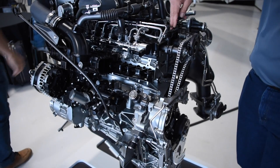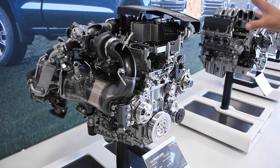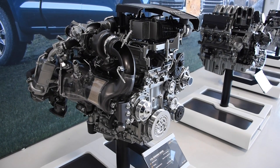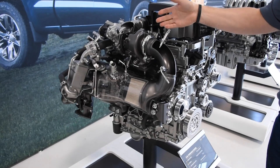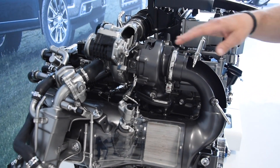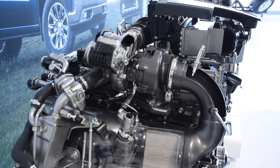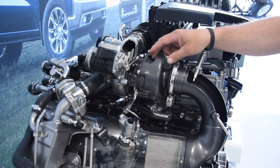The injectors are top-centered, really at the top of each piston. Low compression ratio — 15 to 1 — helps us on emissions. Our turbocharger is what helps us get our power so quickly. The electronically controlled VGT turbocharger gives us 29 pounds of boost. We have roller bearings in here, which is new for us — previously there were journal bearings. It spins up to 175,000 RPM.